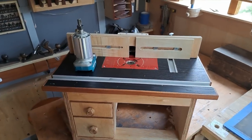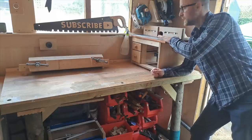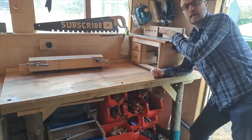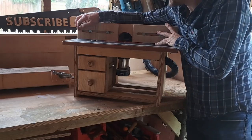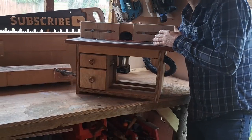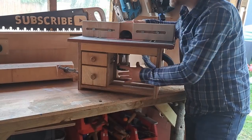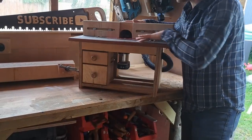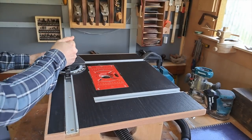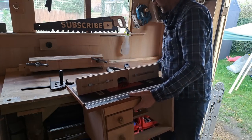I've been watching a lot of people recently who have made tables, and I see them selling online for £200 to £300. I genuinely think that this is sturdier and has more features on it. It's got the adjustable fence so you can close it off around the bit, the fence moving back, and double dust extraction — one on top, one on the bottom onto the actual router itself. Storage built in and a track on the front for a mitre gauge. You can also put feather boards on there and clamp it onto the workbench itself.